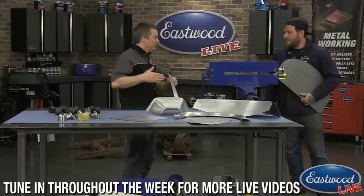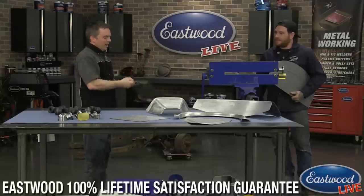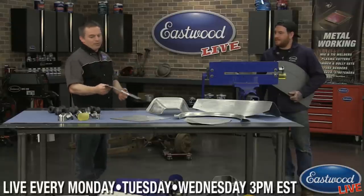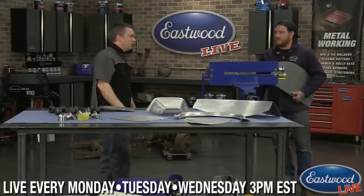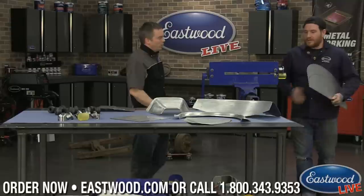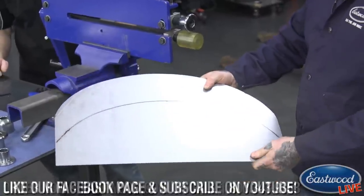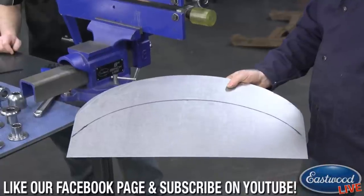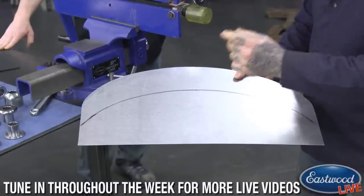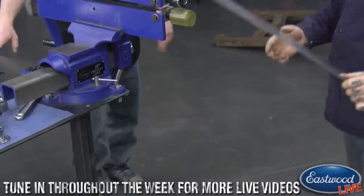If you plan out your panel correctly, you can actually move metal in interesting ways. This is what I was going to do to make a rocker panel — because rocker panels a lot of times front to back have a little bit of an arc. If you're doing a small patch and you don't have a shrinker stretcher, you can actually do some of that with these forming dies. It's all in the line you draw and the angle you follow. If you put an arc in the panel, we can actually make the metal move in two different directions — which we're going to show you.